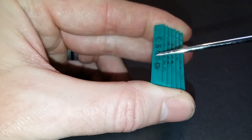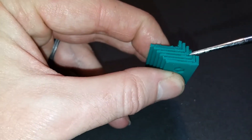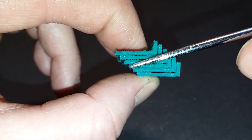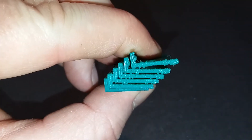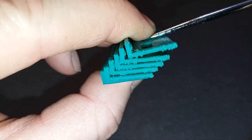I'll stack these up to show something I discovered during this test. With the prints stacked from 5000 down to 156, look at the edges — the only thing I changed in Cura was the acceleration speed. As I decrease acceleration, you get blobs on both ends. The 5000 has no blobs, very minor blobs appear lower down, and it gets worse as acceleration decreases.